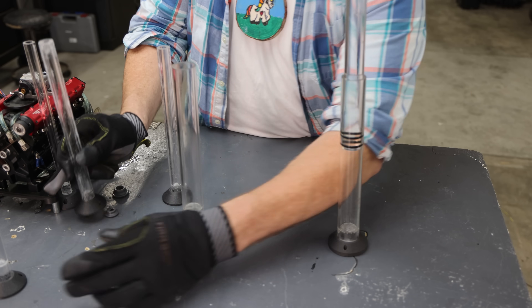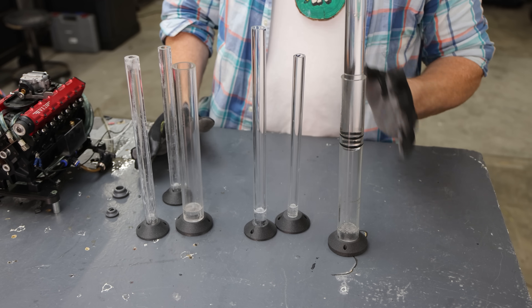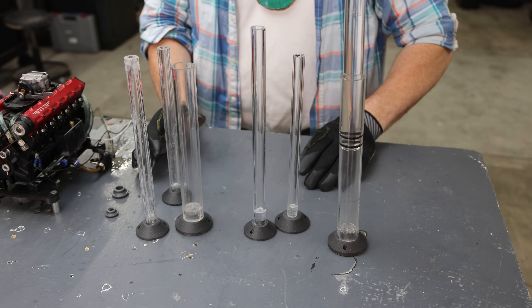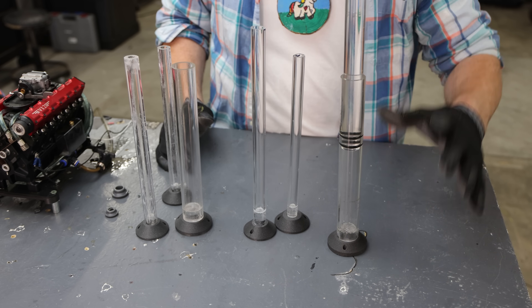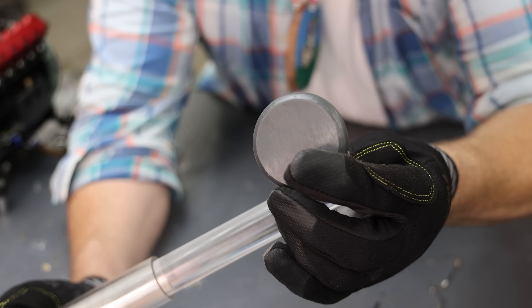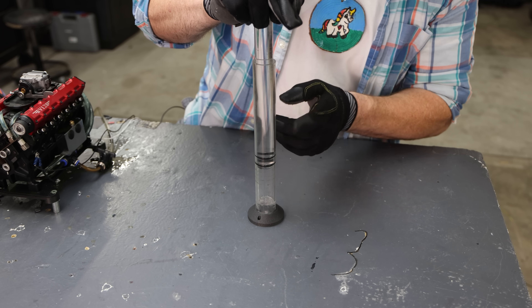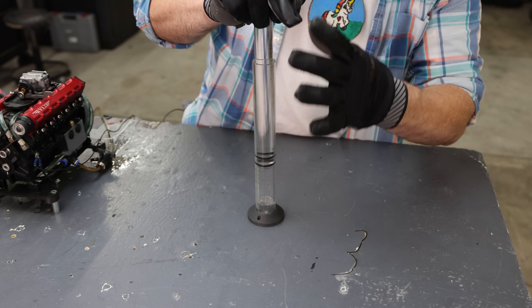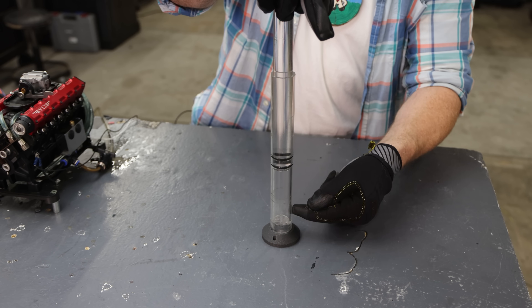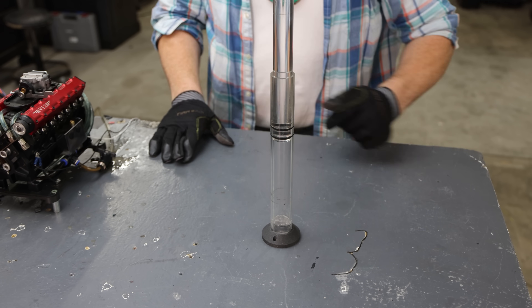If we look at any one of these fire pistons I made, I based almost all of these off of a 25-to-1 compression ratio. A diesel, from what I remember, is about 23-to-1 compression ratio. But in the real sense, we're going to be limited by the amount of pressure we can actually apply. I printed these on the Formlabs printer, and if we do the math, when this is fully compressed we have about 370 PSI — which is about 350 pounds on this piston. I don't think I could apply 370 pounds of force that quickly, so I'm just going to smash the top of the piston with a sledgehammer, put the high-speed camera on it, and see what happens.